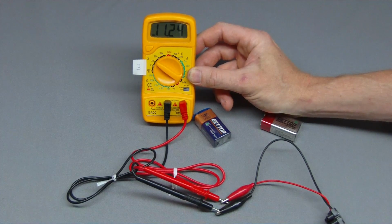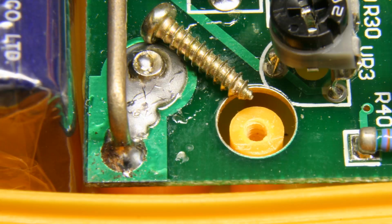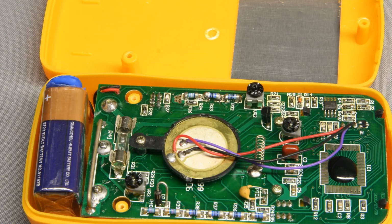At the low budget instrument used in this video, the values diverge in such a way that they are outside of the given accuracy. There is another decisive reason not to buy a low budget multimeter, namely the build quality. To be able to replace the battery, 2 screws with a plastic thread have to be loosened. After approximately 3 replacements, those threads are ruined and the cover can't be closed properly.